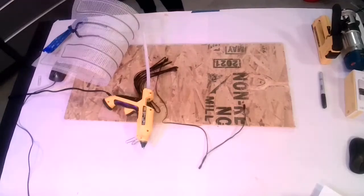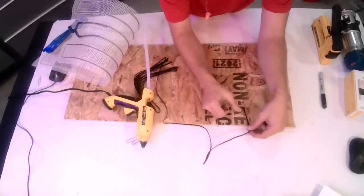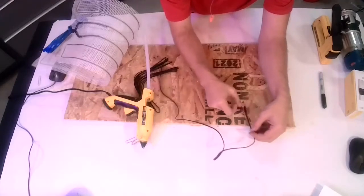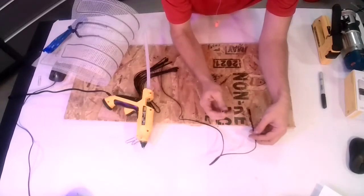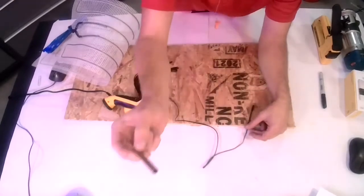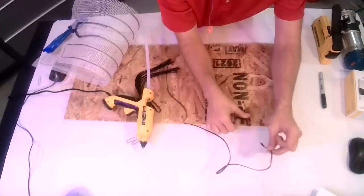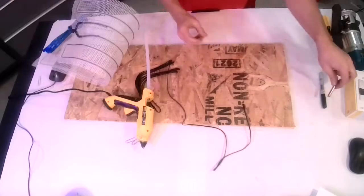Another method you can do, you can actually use a piece of copper tubing. In most of these installations, your temperature sensor is pretty permanently stuck down in the floor. But they do sometimes go bad, and in a tile floor, there's a couple different methods you can do to add one or replace it. One method, used by one of our OEMs for the RV industry, is a copper tube, just a little piece of tube, which allows you to slip the temperature sensor inside. You put the whole tube down on the floor, and if you bring it over to the edge, you can actually slip that temperature sensor out if you have to. In this case, we'll just glue it in, but it's a good idea depending on what you're doing.